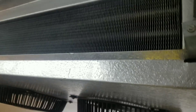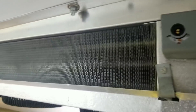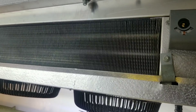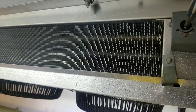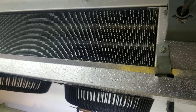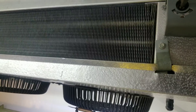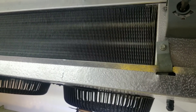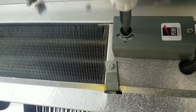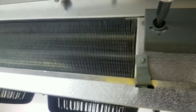I'm not sure if it's picking up on camera, but there's a hissing noise. And it's probably, if I had to guess, it's probably my TXV underfeeding, meaning we're low on charge. But first, let's see if we can hear a click. There's our click. So as soon as I turned this thermostat up to 60, my liquid line solenoid closed and the hissing stopped.